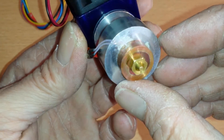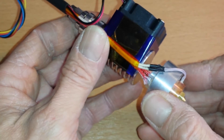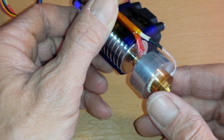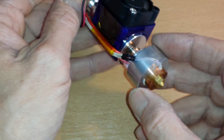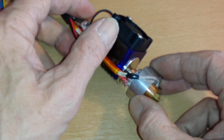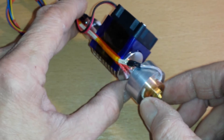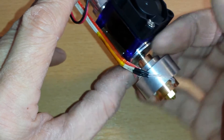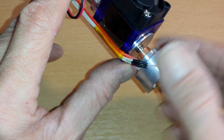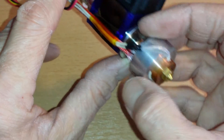It's as close as I can get it without putting it at risk of easy damage, so it's cemented in with some 1200 degree resin cement. It easily holds 400 degrees, which is way beyond what I need. I suspect 330 to 350 degrees will be the maximum I'll need for polycarbonate, but I've made sure it will go to 400. This is not complete - there will be an insulation barrier here and probably insulation wrap around to try and stop the absorbed heat from traveling up.